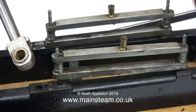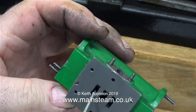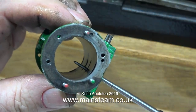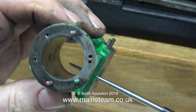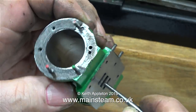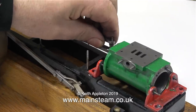Things like this are very visible on any photograph, so it's a good idea to spend a lot of time looking at close details on the photographs to make sure that you're not going to buy a pup — not that I have anything against dogs. Let's have a closer look at the cylinder. I did say I was going to save the best until last, and here it is. Whoever built this engine had no concept of how a steam engine works, and had managed to mill the slots all the way down into the cylinder. This is the first time I've ever seen this, and when I saw it, it made me laugh. And to add insult to injury, there are random holes drilled around the flange of the cylinder where they've been drilled in the wrong place. The special feature of this engine are the see-through steam ports. My first instinct is just to throw away the cylinder — the bore is okay, but it's no good at all with two holes machined in the centre of it. This is an ideal opportunity for a major league bodge — should I plug up the holes using JB Weld, then reassemble the engine, put it back on eBay, and wait until the bids come in?